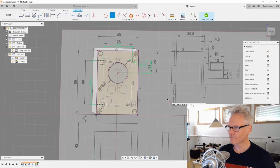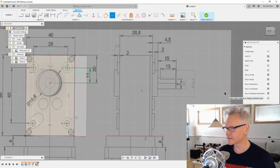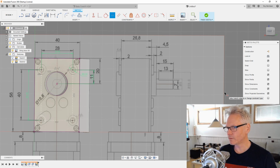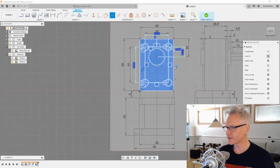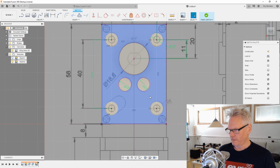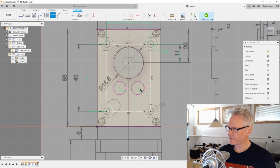And we probably, if we look at the right side of the drawing, looks like more of these extrusions are all 2mm out, so we can try to get everything that's 2mm out into this drawing, this sketch we are working on. So another circle, and I'm gonna pick the center point here, and another 8. Just another circle, and I'm just gonna put 8 again. And doesn't look like there are any dimensions on those guys. We are just gonna ballpark them. Looks like 15 is a nice fit here, and probably also 6 here. Look to be right.